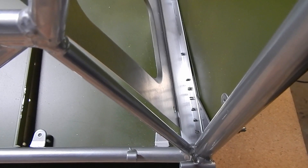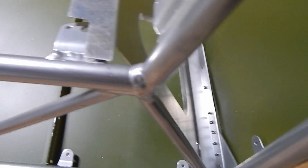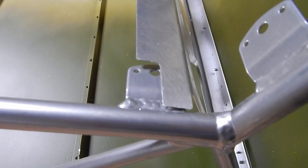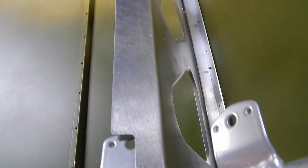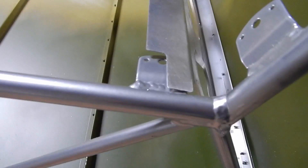The other question I had was where the S3, S4 support lines up. I saw others that left this tab just coming up to the cage, leaving one rivet hole there, with the back end riveting onto that closeout or bulkhead. That's the way I've seen others do it, so I'm going to do this as well. Remember, this comes in contact with the cage, so this is going to have to get primed also.